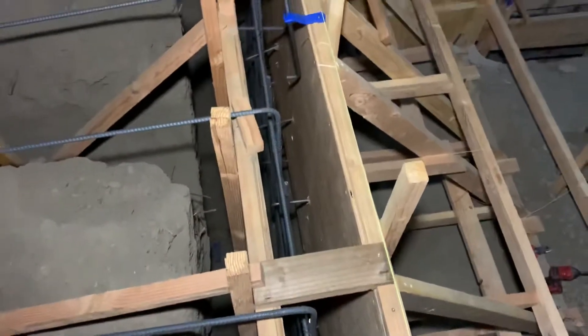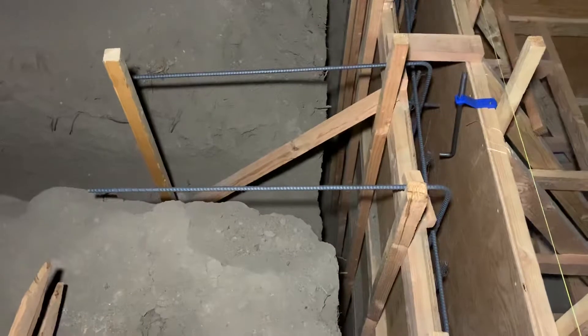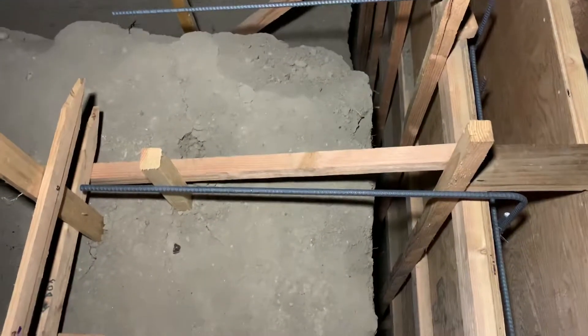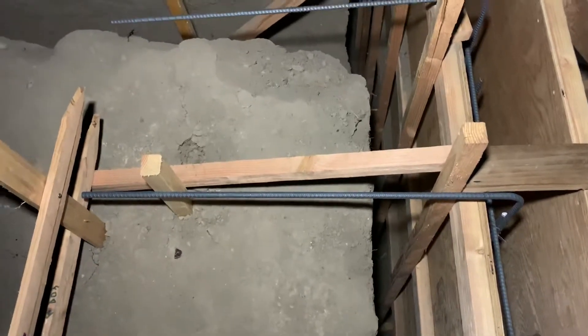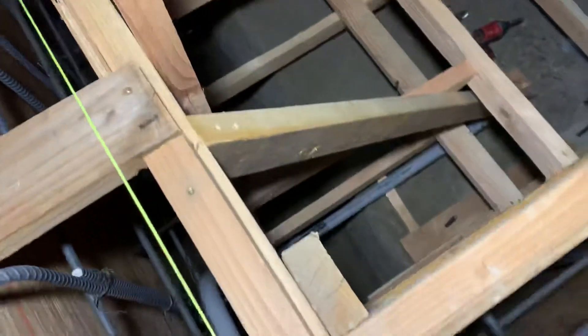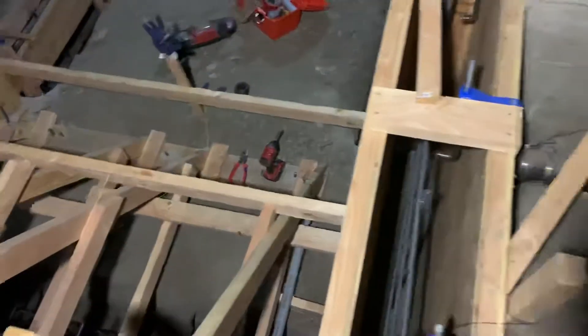You can see here they got their 90-degree bends coming around — about over three feet when it comes to splicing for rebar. That's essentially when they tag on to this later on when they do the slab and come across. We got stairs coming up here too — you can see they got threads sticking through here and there so it can attach to the wood that's going to be starting off the stairs.